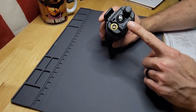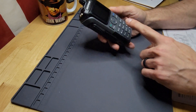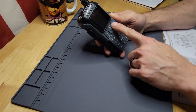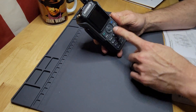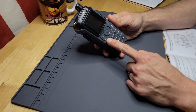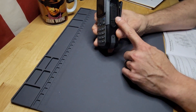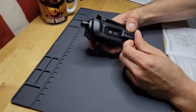That part right up here that looks like a gray button is actually your LED for talk and transmit. You have your color screen. The menu key is right here, the exit key, your A and B switching between bands A or B that you're watching, listening to, and transmitting on. Your VFO and memory channel selector, your keypad, your speaker, navigation keys for your menus, and your Kenwood-style speaker-mic connector area.